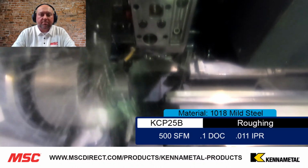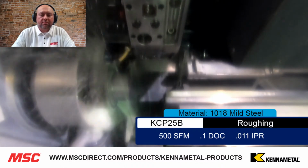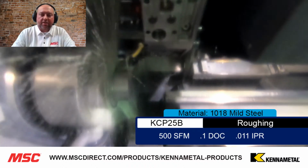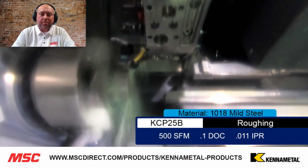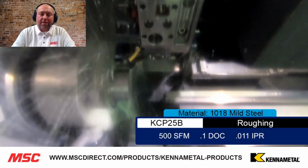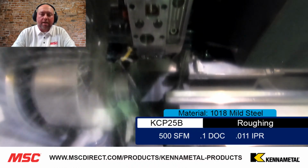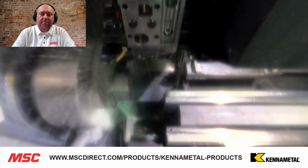Yeah, that's a very good point. And as it continues to do work here at the spindle, do you have any specific applications where you feel this insert, using some of the old school method, we might see it utilized a little bit more in the field? Exactly how Aaron's demonstrating here. It's a great general purpose grade. If you're a shop that just does one piece, two pieces, and you're not overly concerned about your time, this is a great grade to use. Now, if you're getting into runs where you're doing 5, 10 plus parts, or maybe even running the same part all day, every day, you definitely want to optimize your grade selection and your cutting parameters to get the most bang for your buck out of that machine.